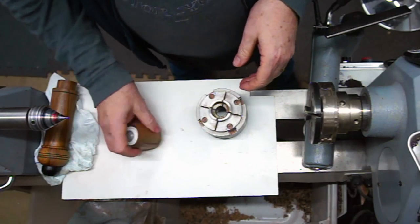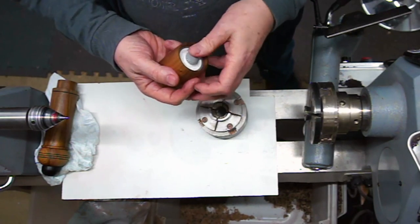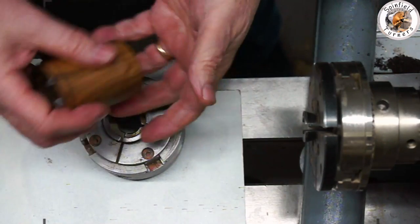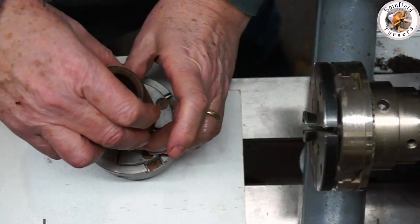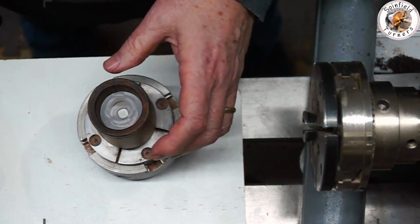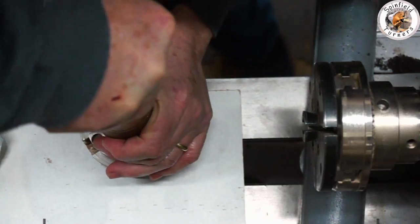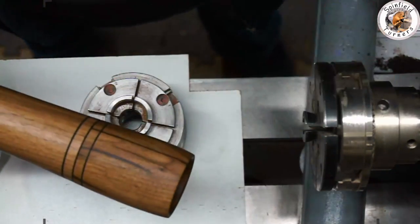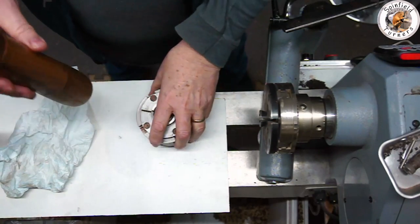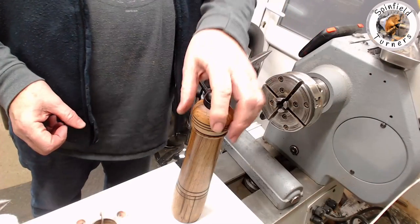All I've got to do now is get the bottom on. The crush grinder has spines on the side that grip with quite a tight fit — you've got to push up on that. I've discovered the regular 35mm jaws are just the right size for this to sit in so that when you push it in it goes into the base and doesn't damage it. And it's now clicked into the recess. So there we have my first combined salt and pepper grinder shaker.